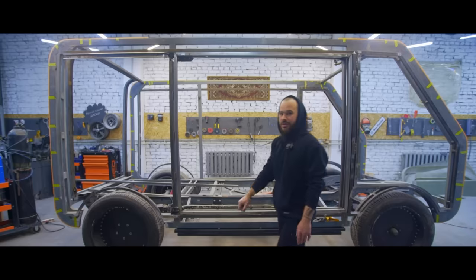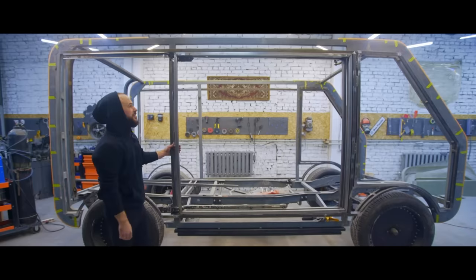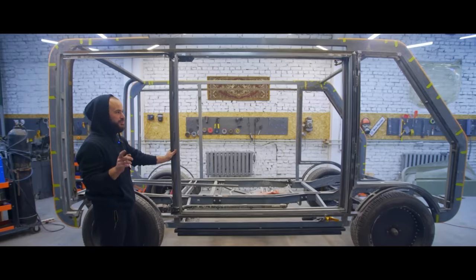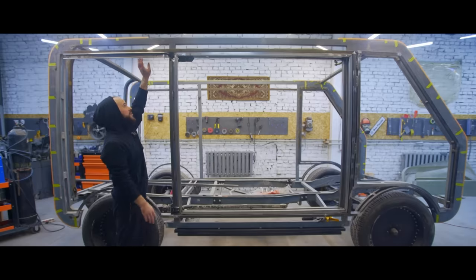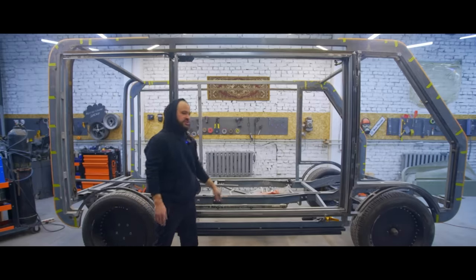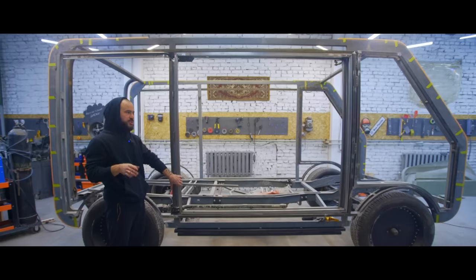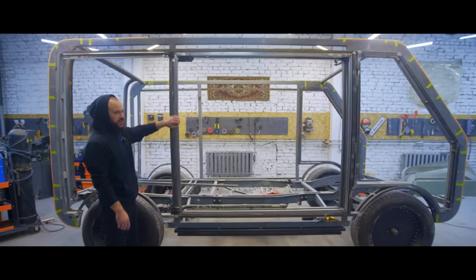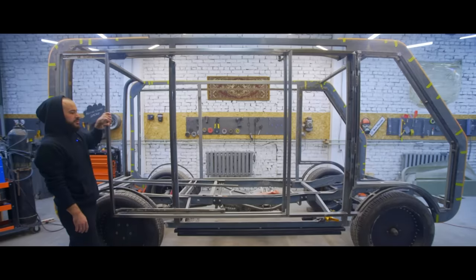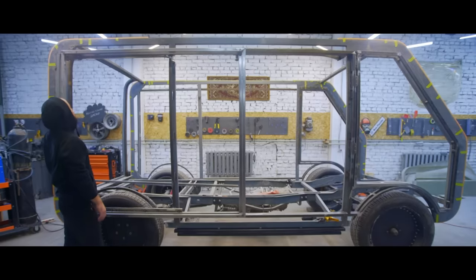Hey, didn't you have any other vans? Only Gazelle and MIDI, is that it? We had only them. Mercedes Sprinter is a nice van, too expensive. But Gazelle has one great advantage in comparison with Mercedes, Isuzu and others: all its runners, the top, the middle and the lower ones, are removable, they are not part of the body. That's why we use the Gazelle. There's a lot of them, you can easily buy them new, they are easy to maintain, easy to buy parts. As a result, the door opens perfectly.